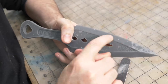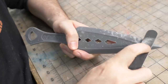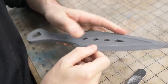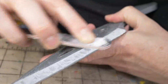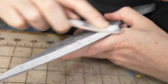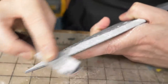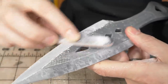Now that I've removed the bulk of the support spots, I'm using a nail file to remove the rest and level everything out. The opposite side is pretty much good to go — I'll probably prime and sand that once. One nice thing about SLA printer resin is that when it's fully cured, it sands really nicely — much nicer than trying to sand a PLA print from an FDM printer. It's rigid so it doesn't gum up. This whole thing is going to get sanded as smooth as possible because I'm planning to make a mold of it.